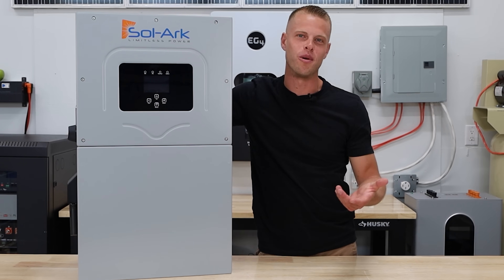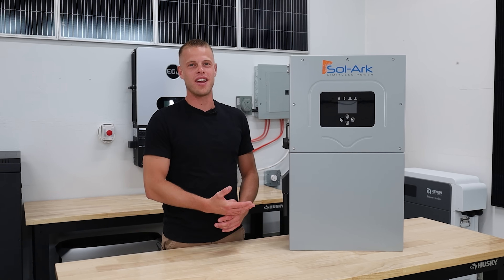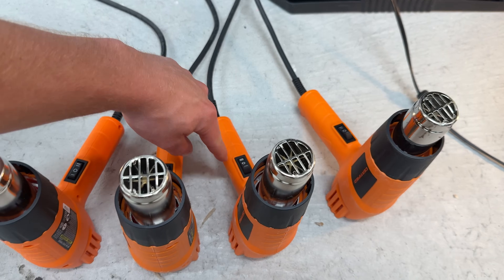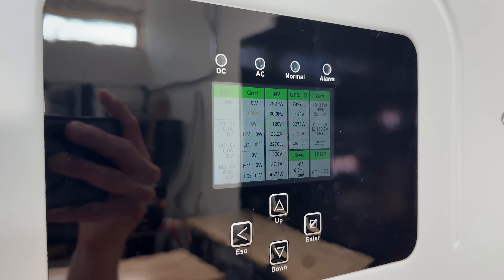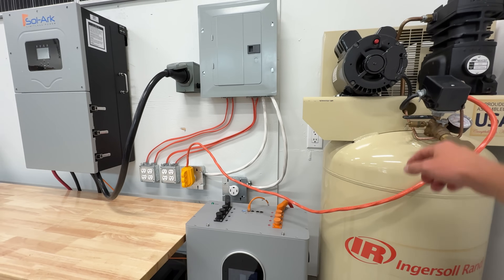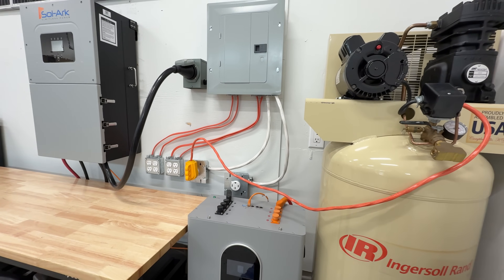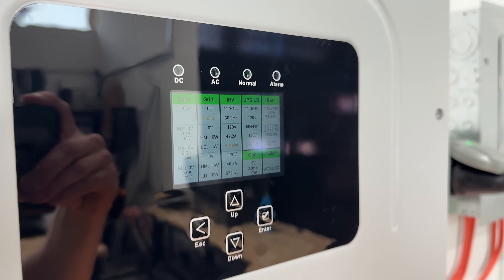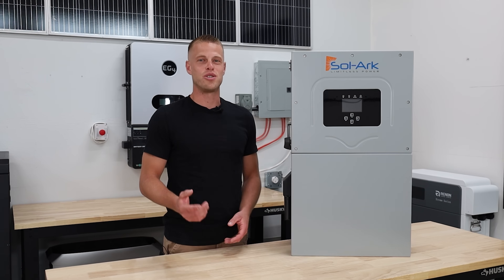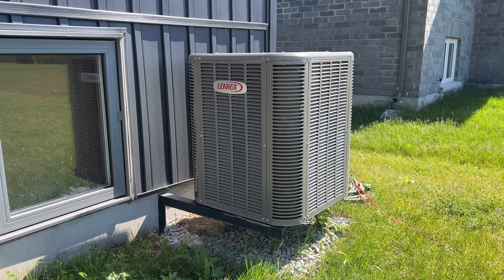Which is kind of expensive, but the quality might be worth it. Right off the top, the things that we like about this guy: performance. When you're buying an inverter, that's probably the most important thing, and this guy nailed it. We were able to cruise it right at its capacity as long as it wanted to run, with no issues at all. We were actually able to start our compressor when this guy was cruising at its 15,000-watt load — twice. That compressor has a surge rating of about 10,000 watts, so to be able to run at 15,000, start the compressor, shut it off, and start it again is insane performance.